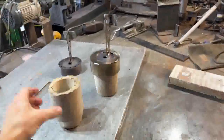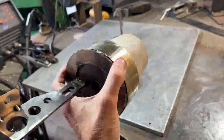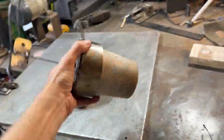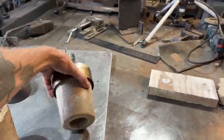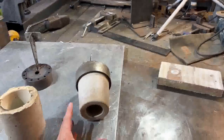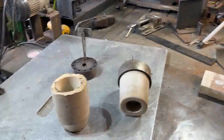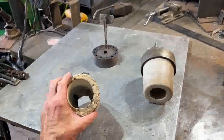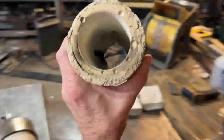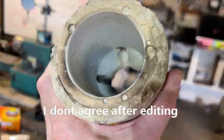This thing did phenomenal on waste oil. I may have to do some further testing on this nozzle difference. I don't feel like I've ever been able to turn the fuel and the air all the way up like that. The super secret high-tech grooves did nothing that I could see. In fact, it made a couple of cold spots.